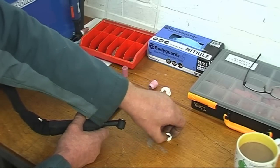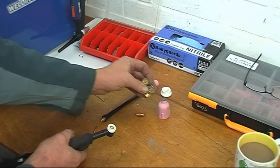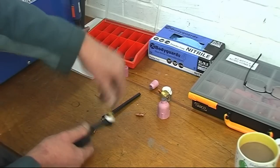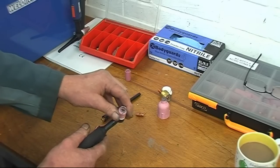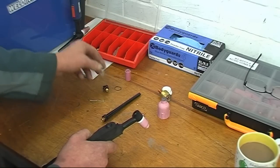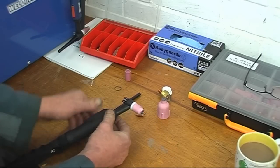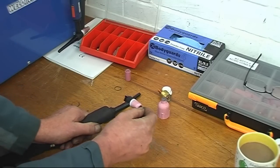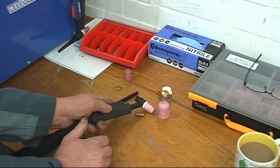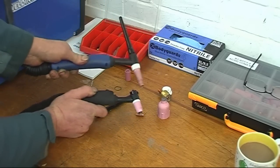I've also got a standard gas lens for it — same design, just smaller. That screws into there where your cup goes on, collet goes in the back. What you can also use is a stubby back cap to make it smaller again. With a gas lens kit, you can have the tungsten sticking out a lot further — all the way out there — which is ideal for getting into corners where you can't normally get in tight. You can see how much smaller the torch is when assembled compared to the bigger one.